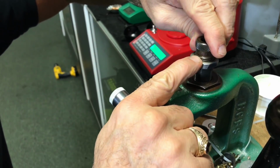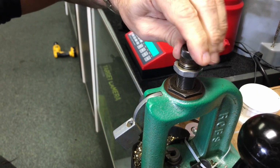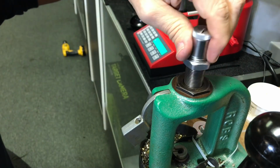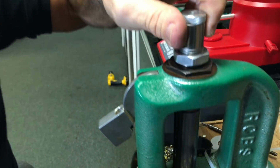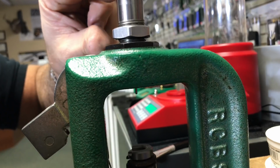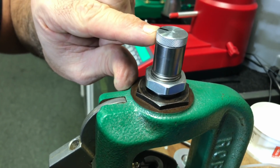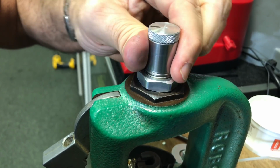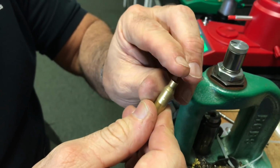Be right back. Sizing my brass with the small base sizing die first. I took my decapping pin out and my neck sizing decapper out of it. Expander ball. I'm going to stick my Lee collet die in here. Run the ram up till it touches. All right, it's touching. Now Lee says, on any other press except for Lee, they say to give it 2 full turns. So that's why I put that index mark there. There's 1. There's 2. If you notice, I already had that set up. So now I'm just going to size the necks.